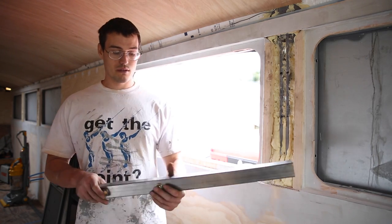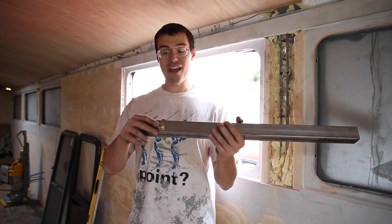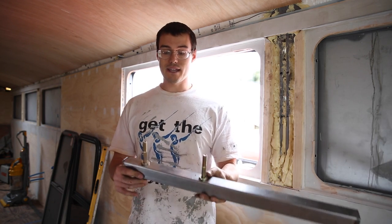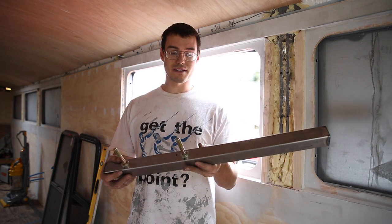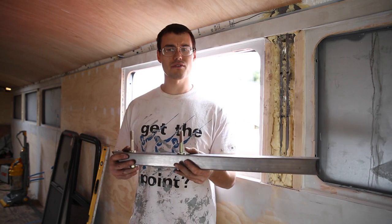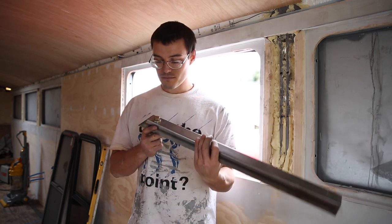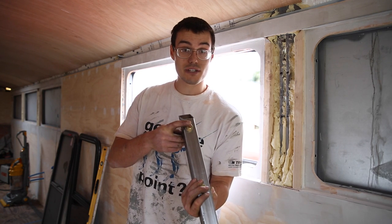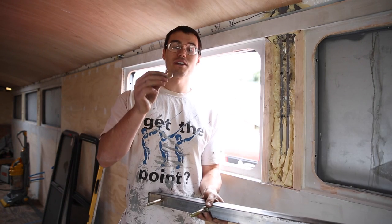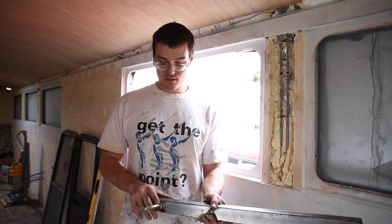So I'm going to show you what went into fabricating a few pieces for the roof deck, and based off of how that went today I think we're going to go ahead and move forward with it. We fabricated these pieces here — it's just a piece of one and three-quarter cold-rolled steel. We've got these grade 8 five-inch long bolts; they're yellow because of the zinc coating on them. Grade 8 refers to the tensile rating — it's a very strong hardened bolt, the highest grade we felt we needed. You can tell because it has six dashes on the head of the bolt. Some of them have a little circled eight instead.